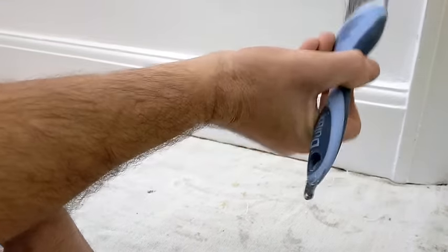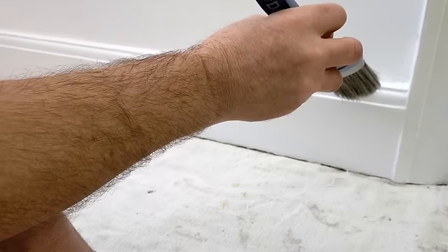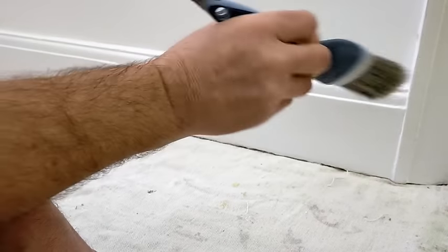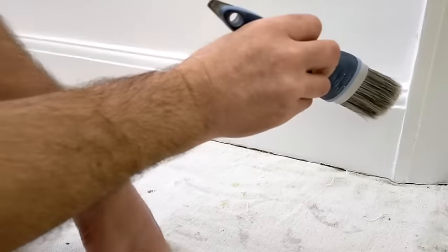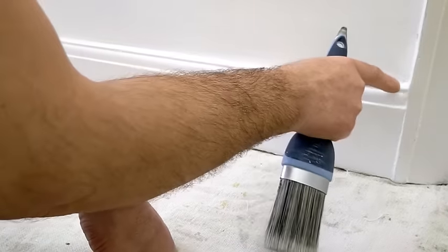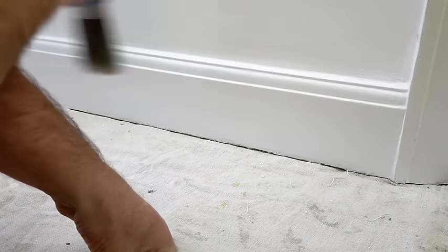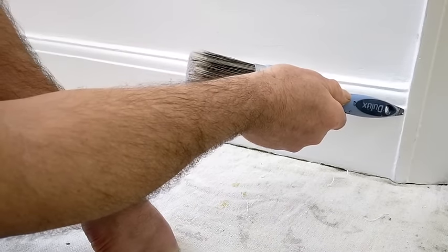Working up to corners, you can apply the paint — working it right, not having too much on. If you have a brush full of paint and apply from here, you're pushing a certain amount of paint ahead of the filament. You can get a build up in the corner, so as you're painting it can start to run down this edge and you'll get a drip forming.